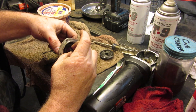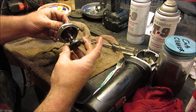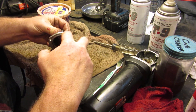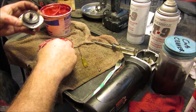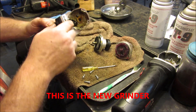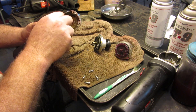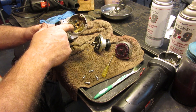I put the key in the keyway with a little bit of lube and I'm putting this back on — it's fairly simple. The thing I do have a problem with is this key wants to turn and fall out, so you've got to kind of mess with it until you get it just right. Got that on there. I'm going to put some lube on the teeth here as well. It looks to me like this one is staying a little better, but there is no clip on here even though you can tell there should be a clip right there. I don't like that — I think that is a flaw that they're saving a few pennies on.